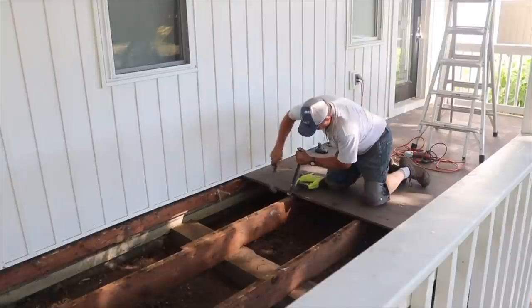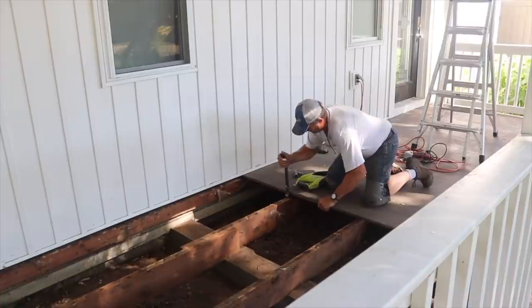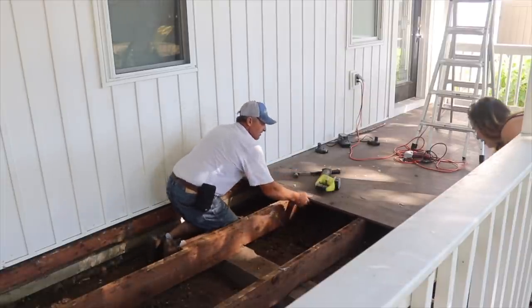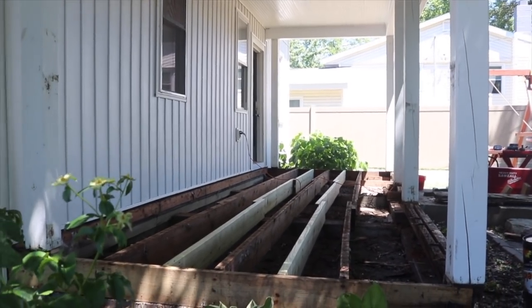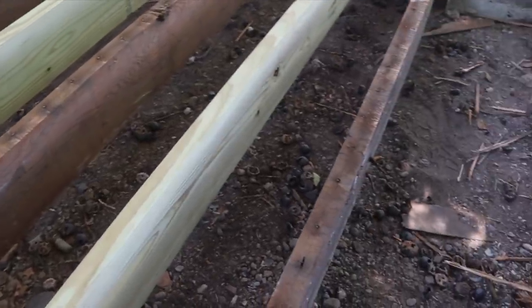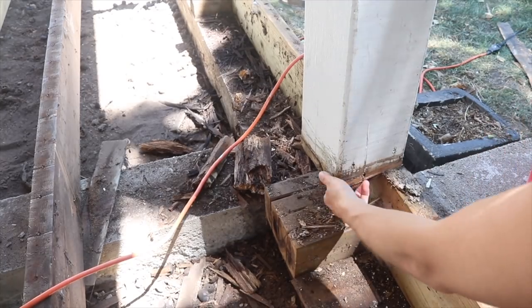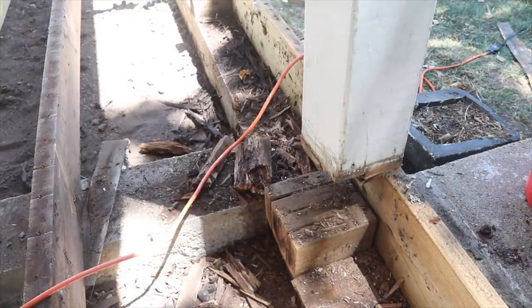And here is my awesome handy neighbor. He is using the reciprocating saw here to get that nail out that's underneath our siding. Fortunately, the new siding we had installed is installed at a height where the depth of the floor we're taking out is the same as the depth we're putting in, and we don't need to adjust anything or add any molding. Once everything was actually demolished, we could see the scope of the rot, and it was actually worse than I was expecting. We're going to be adding in not only extra joists that run 12 inches on center for the composite decking, but we are also going to add sister joists on what was currently in the front, where all the rot happened along the edge and gets exposed to rain a lot.